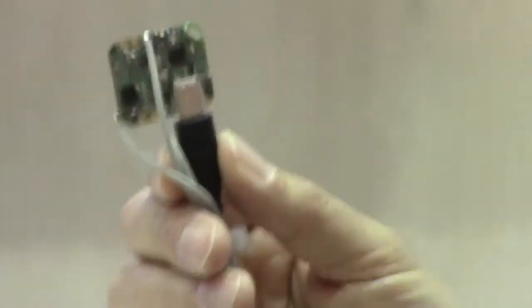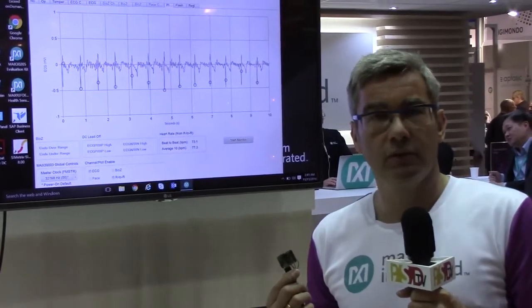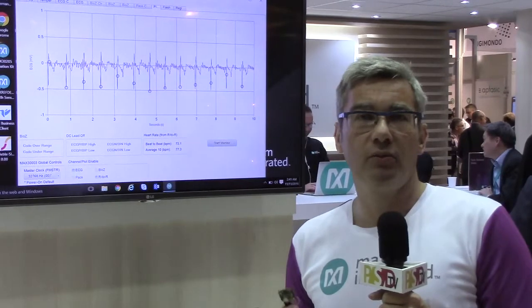This part is not currently running via USB. If you order the EV kit, you basically get the holder for a battery. We have a PMIC on that for lithium batteries — it's the MAX14720. If you use other batteries, Maxim released a couple of PMICs for the wearable market for all kinds of batteries over the last two years. And if you go online, you will find five to six new products under that as well.